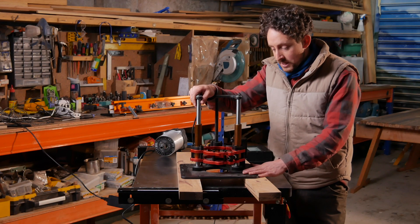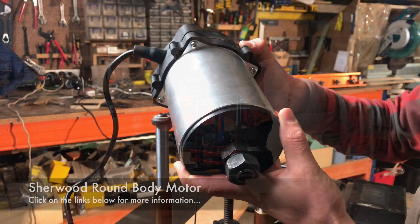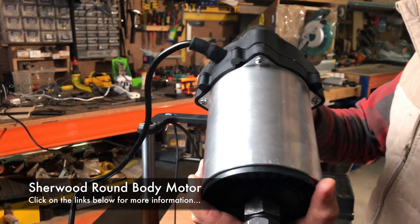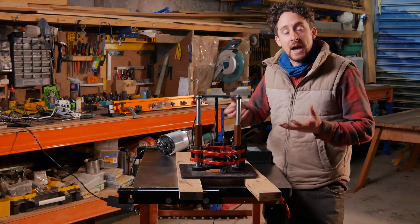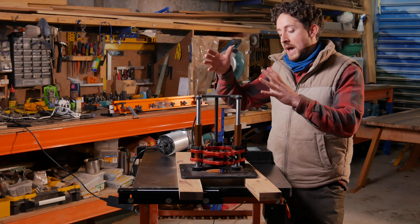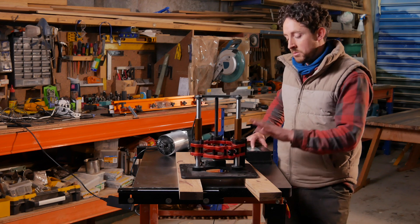This is a router lift designed to hold a round body motor. It will not fit a plunge router or a Triton or whatever standard handheld router that you can sometimes install on tables like this. Rather than having a winding mechanism you use through the top of the router table, it actually moves up and down with a keypad, a servo motor, and it's all digitally controlled, meaning you can move to within a tenth of a millimetre at a time. It is super accurate.